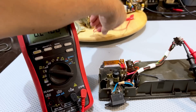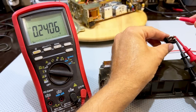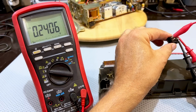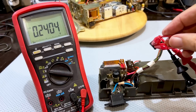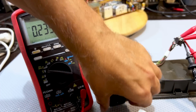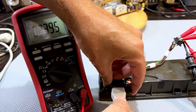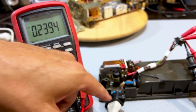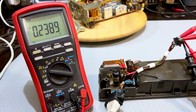One more thing we need to do is we need to switch this circuit on. So we need to short these guys over here. This is acting as a switch internally on the radio, so we short that out. Keep everything out of the way because this thing's going to have mains on here. Now I connect a plug onto here and make sure it's not touching anything. I've plugged it in, and let me switch it on and see what happens.